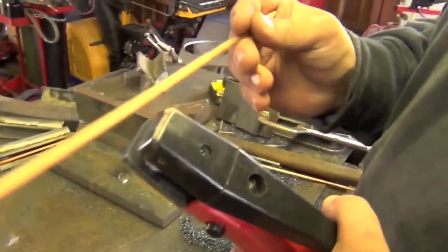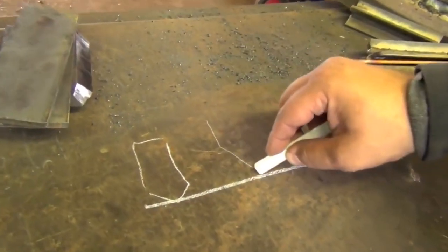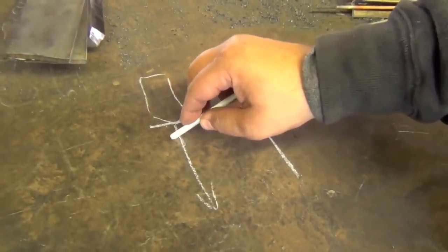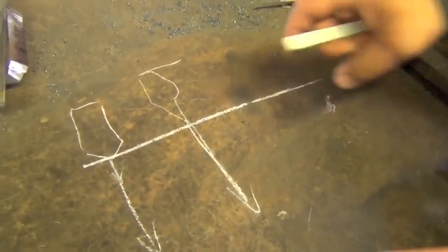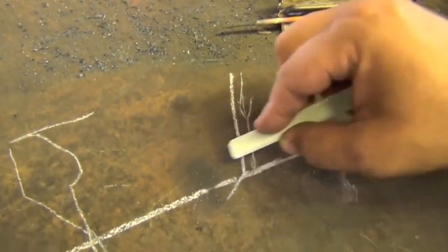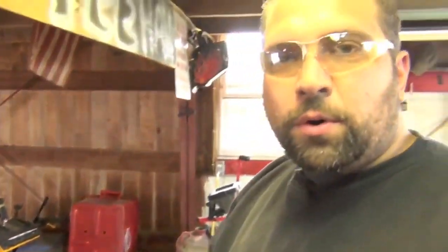What this does is, it's like reverse stick welding, let's say, or shaving material off. When you have your plate and you have your plasma cutter or a blowtorch, the flame usually blows through, sometimes as little as half an inch, sometimes as much as 2 or 3 or several inches. The special thing about the air arc is the carbon rod creates a molten puddle, air is coming down behind the rod, blowing the puddle out, and this causes it to just shave material off the top. So we can either remove layers of material or even remove a weld, ideally with a little bit of skill, without damaging the parent material that the weld is attached to.